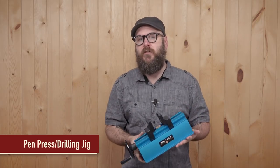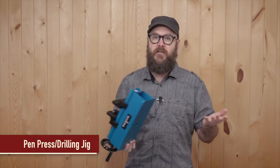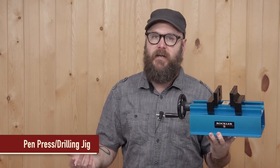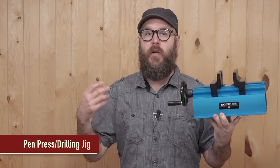It is a lot faster using a dedicated pen press. Once you make a couple pens you'll find that the process is pretty darn easy and they're really quick to make — therefore they make great gifts and you can turn a profit on them. The kits are really inexpensive. If you're going to batch out a bunch of pens I highly suggest getting a pen press. It nearly eliminates error when assembling the pens and makes the process easier and a lot faster.